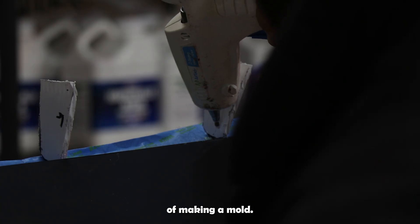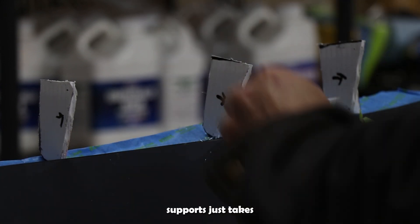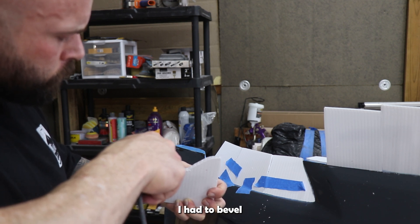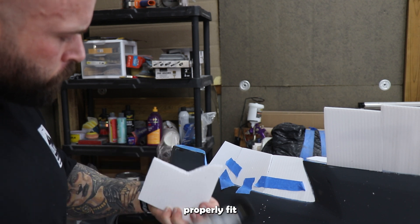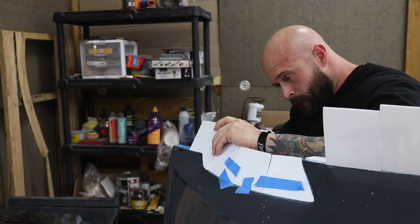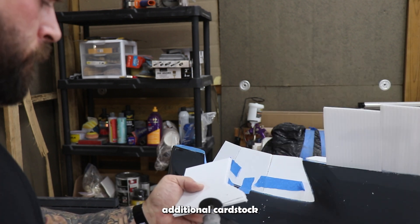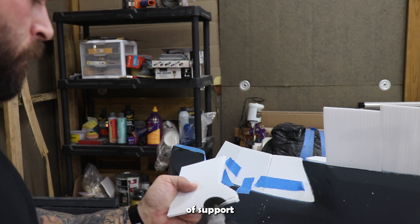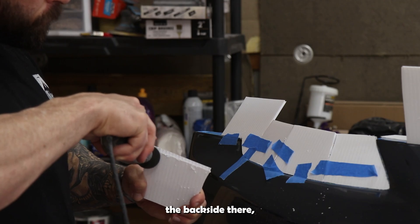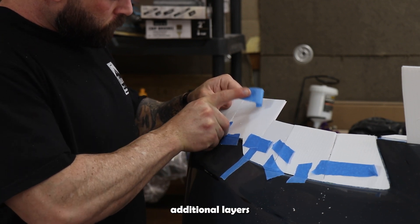This is probably the most tedious part of making a mold — all the flange work is extremely time consuming, and needing supports takes a ridiculous amount of time to cut out. I had to bevel the edges of this cardstock so it would properly fit on the bumper and give me the exact angle I wanted. Just more hot melt glue securing it to itself, and on the back using additional cardstock to glue pieces to each other for support. Once you get enough hot melt glue in there — throwing it on like a MIG welder along the back side — it will be very secure for applying clay, gel coat, and fiberglass layers.